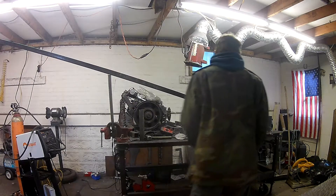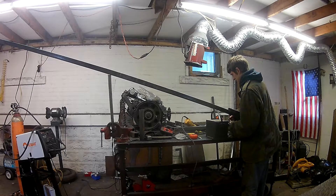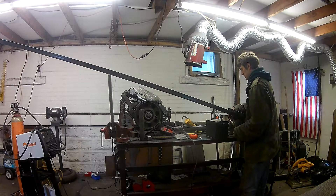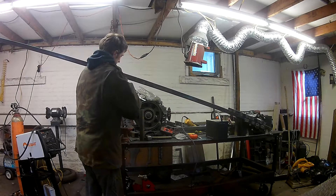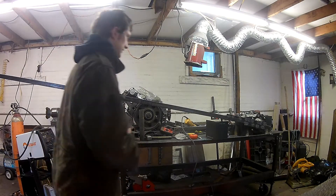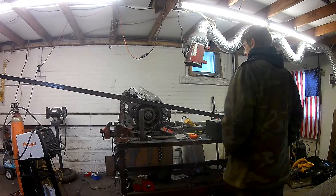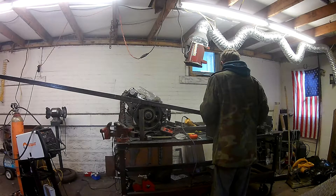Keep it up in the air because there's a lot of deflection that occurs due to the backlash and whatnot. What I'll do is energize the coil — the clutch is actuated right now. Move the stop, see how much torque it can handle. As you can see, it's just kind of levering off its own clutch right now. Body weight across the two-foot mark.